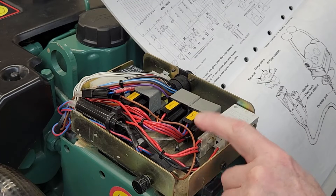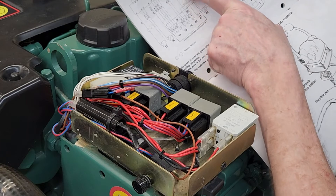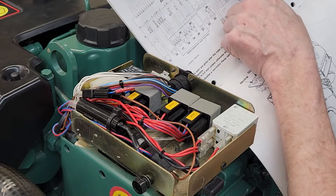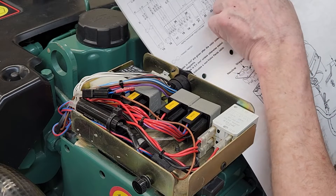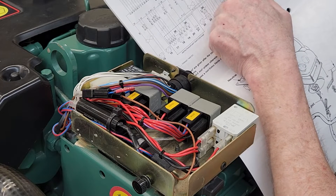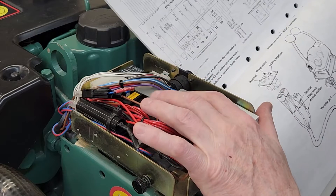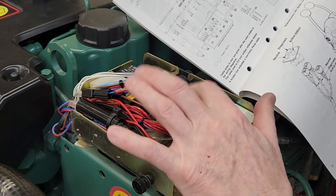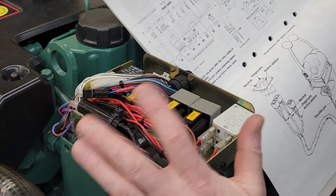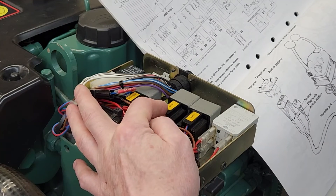The first relay, the stop relay, sends power down to the actual stop solenoid on the injection pump right here. That comes up on a red and blue wire — you can see the red and blue wire coming off of here — and that wire comes off of number 11, which is the stop relay. When the stop relay is energized and the contacts between 30 and 87 are closed, it opens the circuit for power from the main relay, which is number 10. That basically opens the power that would go into the processor and also opens the power that would go up to the helm switches, the key switch, and up to the actual push button panel.